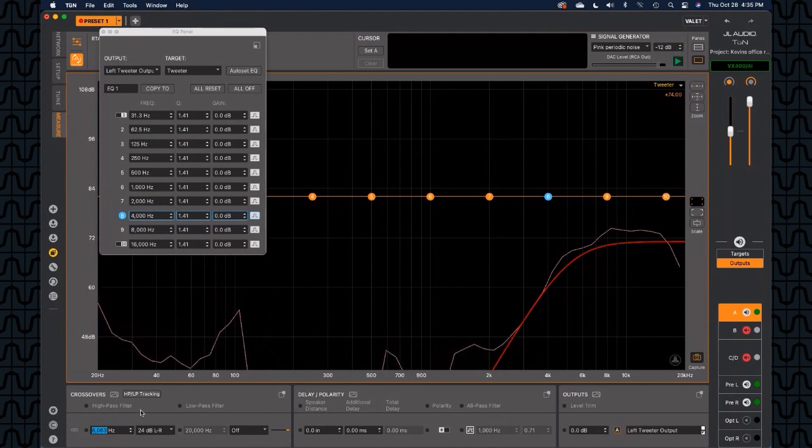Before he does, I don't know if Rob said it, I was looking at the chat a little bit. What we're about to demonstrate will work with or without a VXI or MVI amplifier. But if you are connected to a VXI or MVI amplifier, the changes that are done here will affect the signal in real time, as Kevin demonstrated with the high pass filter. You can use this on any DSP that you may already have. You'll just need to take those values and enter them into your software for that DSP, and you'll see the changes then reflected in the tune measurement software.